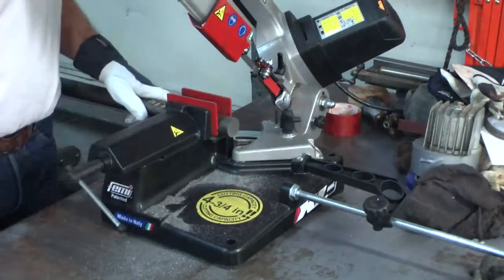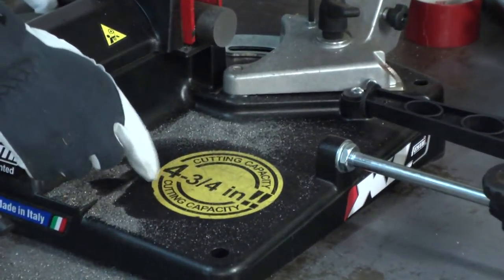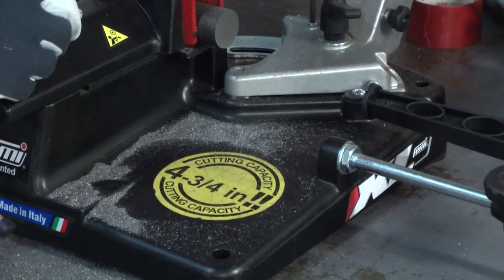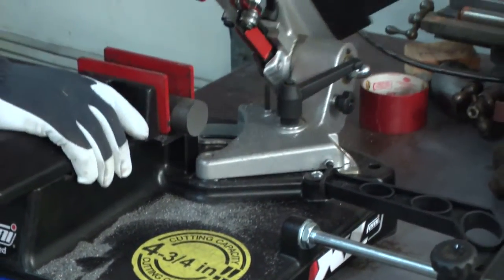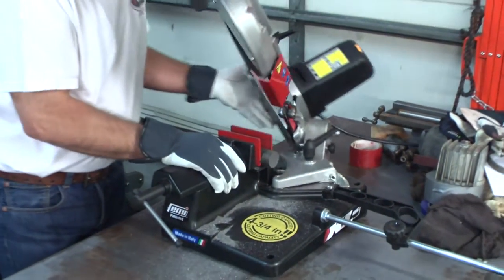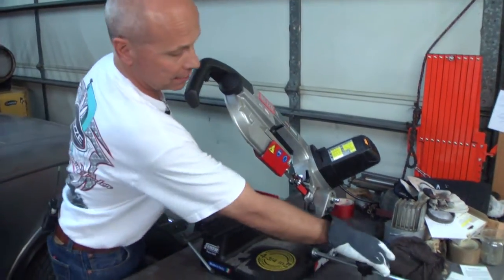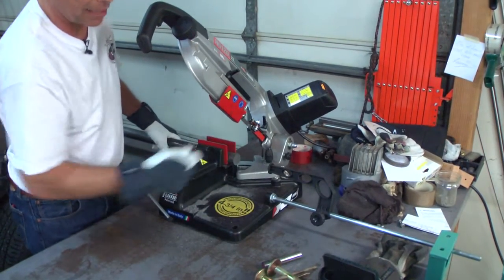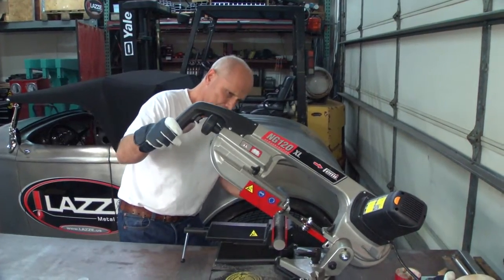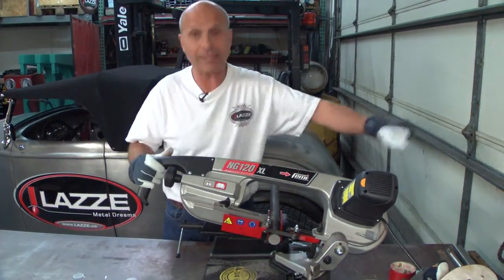This has variable speed too. This Benzo cuts four and three-quarter inch rectangular tube, round tube, or round bar — so that's a lot. You can also turn this so you can easily cut at an angle too. And this Benzo really helped me a lot. I also have a guide here so you can set it and cut the same length on many pieces. It pushes the blade this way so it doesn't pull it, and that's probably one of the keys to why it's so good.